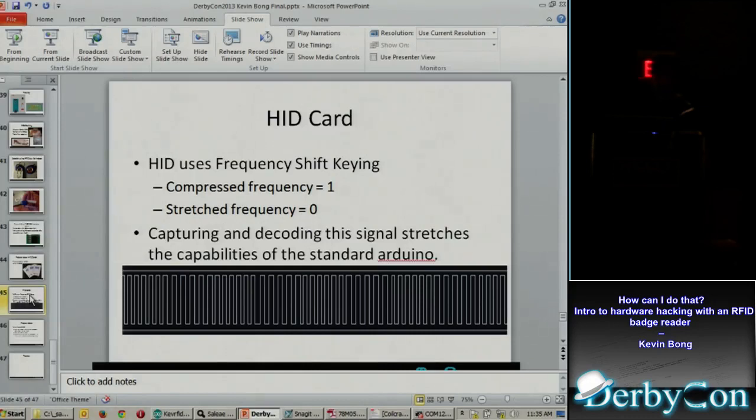The way I kind of got around that is I was able to at least fill my buffer and then just have a tiny bit of code that spits the buffer out via serial, did the decode offline on a Windows machine, and proved that, yeah, it can be done. When I was done, doing some math and all that kind of stuff, I came up with the number that was on the back of the card. Yeah, it can be done.